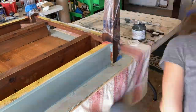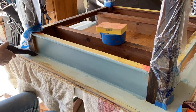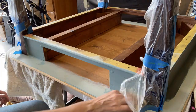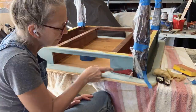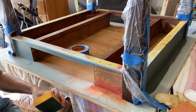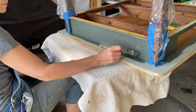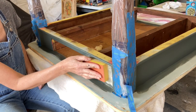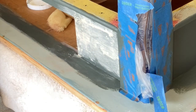I didn't mention this at the beginning of the video, but there was another reason why I wanted to repaint this: the paint was chipping off. This is the milk paint I was discussing earlier — it started to chip off after just a couple of months and I wasn't thrilled about that. But it was very easy to take a chisel to and get off, and I could see the color I had painted it before. It came off pretty easily. I sanded it down, but I needed to put wood filler on it to level it off so it would look smooth. I used Plastic Wood-X — it dries pretty easily, it's easy to sand, and easy to paint over.